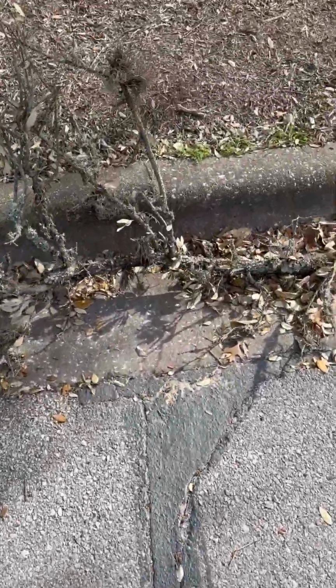We can see this in our own neighborhood of times that they've patched the asphalt. A little bit of a tiny gap, and then the micro trench starts, and this becomes a 1.5 to 2 inch gap with varying degrees of sinkage. So as much as you try to hide this little tiny trench, after 4 or 5 years, this is what it can look like.